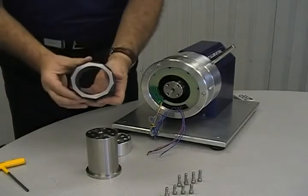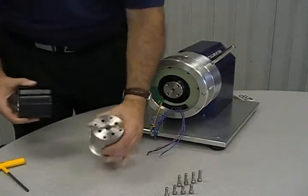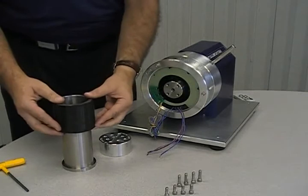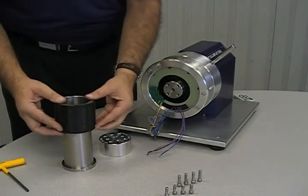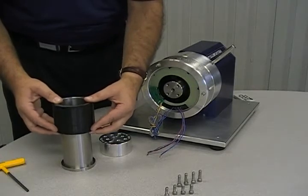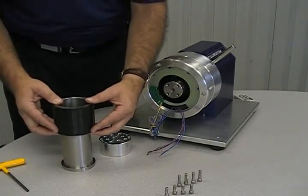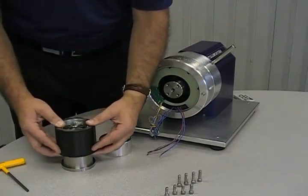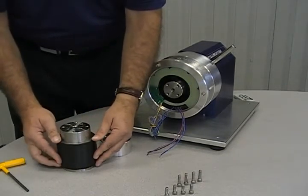The first step in mounting the rotor is to first mount the rotor onto the adapter. Since the rotor and magnet ways are very long, it is important to ensure the alignment of the rotor at the beginning to keep it from binding. If it does not start with ease, realign it. At no time should the rotor be forced onto the adapter. It should slide down smoothly.